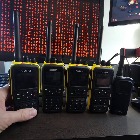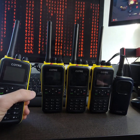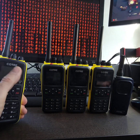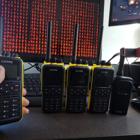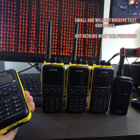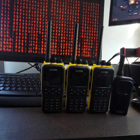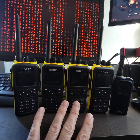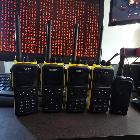I don't think you necessarily need more expensive DMR radios like the ham radios that are $300 a piece, because this will do all the tier 2 functions you'd probably need for prepping. This one was $35 on Amazon, this one was $16 on Amazon — a very great price. I did have to make a cable for this one using a UART bridge USB dongle, but those are only about $2 on Amazon. These will use a standard Baofeng programming cable, and all of the software is available on the internet.